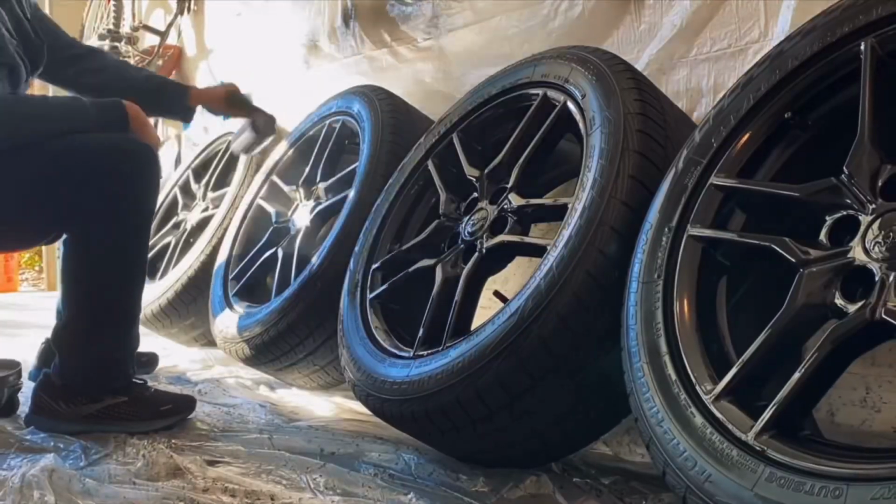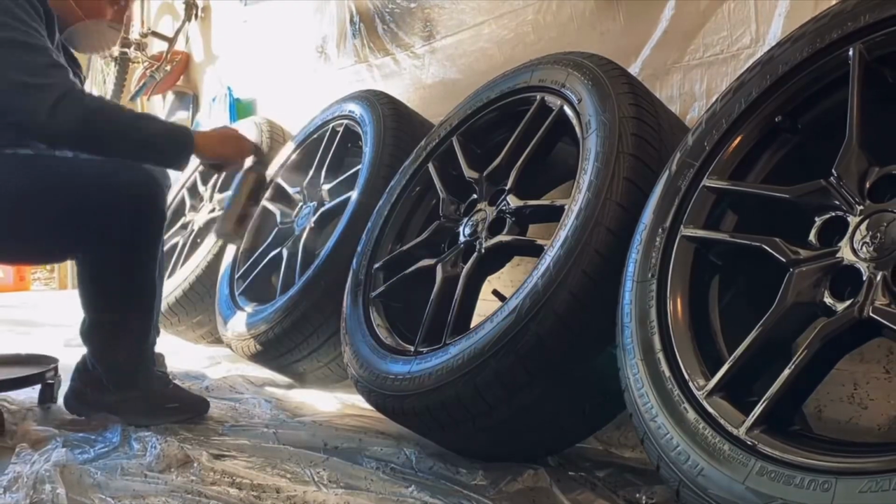The problem I had, I thought I was doing pretty light coats. I think I did 4 or 5 light coats, but I still experienced little runs and drips and things like that. So I was going too heavy on those coats. And it really needs to be like a fine dusting until you build up enough to where you have a little bit more to work with there, and you can start laying it on thicker. So that was another problem. And the cold weather probably didn't help that as well.